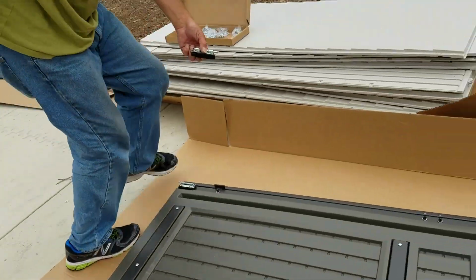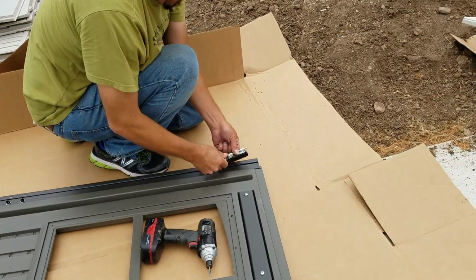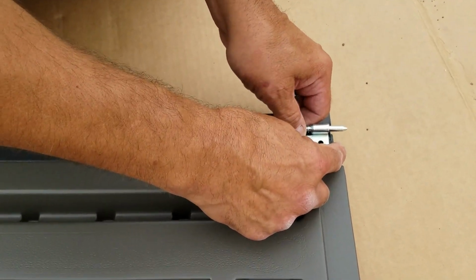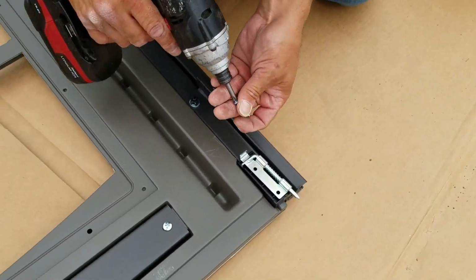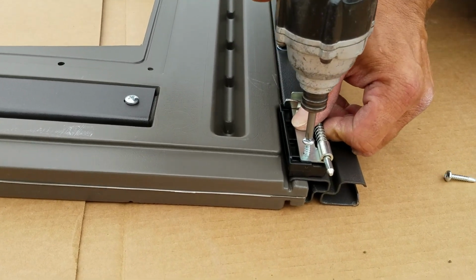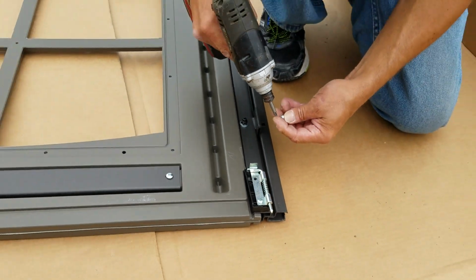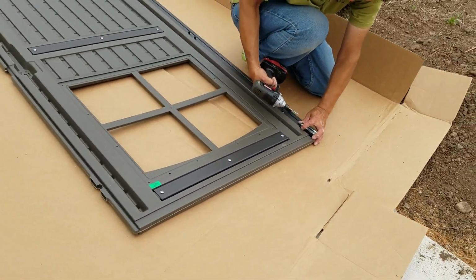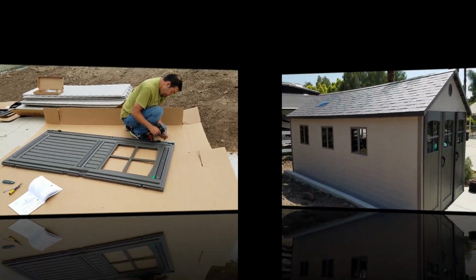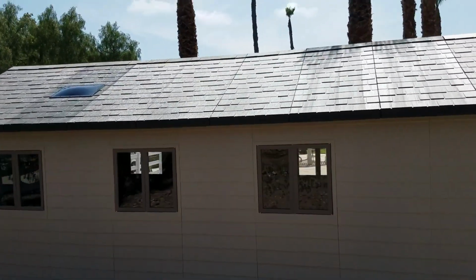And you go insert this deadbolt to the top part of the door. It's the left side middle door, so it's going to get the top and bottom deadbolts, which are going to be going to the bar that goes across that upper gable that you put on, and that's going to lock that, and then the bottom will drop into the bottom plate of the flooring. So you put those 2 self-tappers through there, and I usually hook it on the spring so it's out of the way when I'm done with those 2 deadbolts.